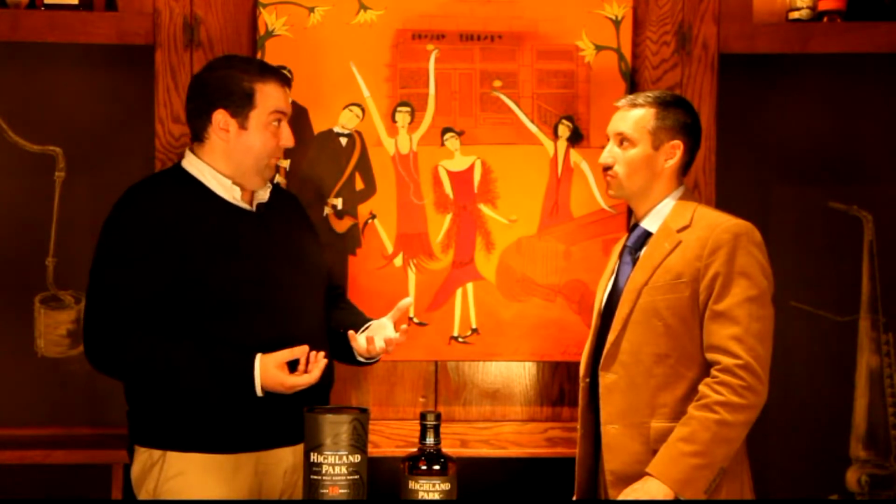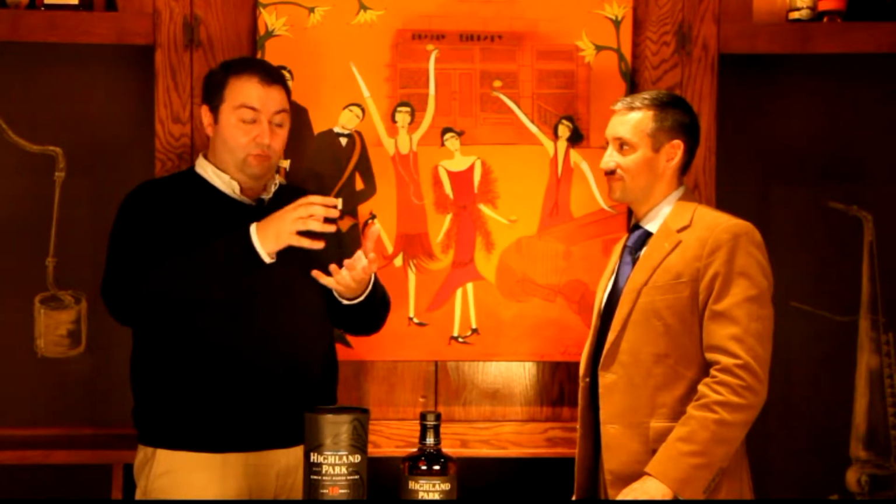So the next step is where we make that beer-like solution. Now, normally when you're making a beer, you introduce yeast and hops. We don't do that. We do introduce some yeast, but we're not precious with it the way a brewer would be, because we're not trying to make a true beer. What we do is we put it into a large tank called a washback. It's about 12 foot deep. And all that wort goes in, along with some water, and along with the yeast. And eventually it becomes a substance called wash. It's about 7% alcohol by volume. They'll tell you it's like beer. Don't ever drink it if you visit the distillery.